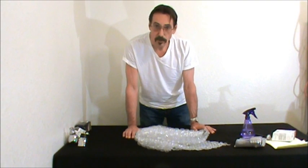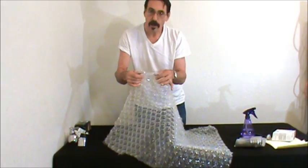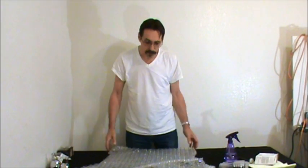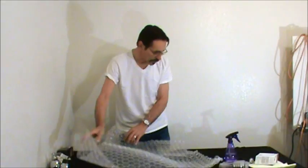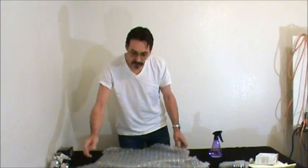This is going to immediately start saving you money in both winter and summer. This is bubble wrap — the kind used for packing with large, about one-inch bubbles. You can pick this stuff up for free: go to a furniture place, they wrap up furniture, couches, and chairs with this bubble wrap and throw it away in the dumpsters. Cut it to size to fit your window, spray some water on the window with a spray bottle, stick it on, and you've got instant savings.